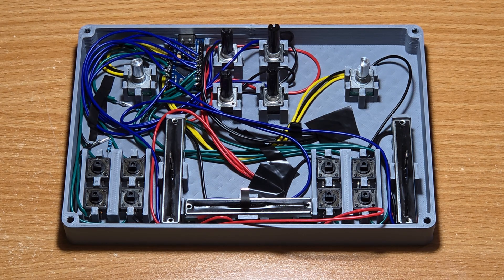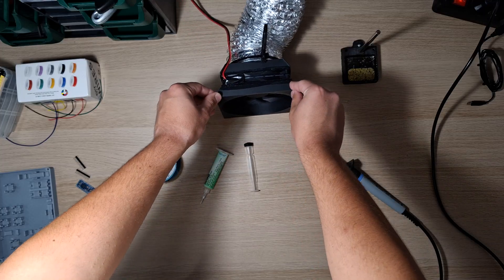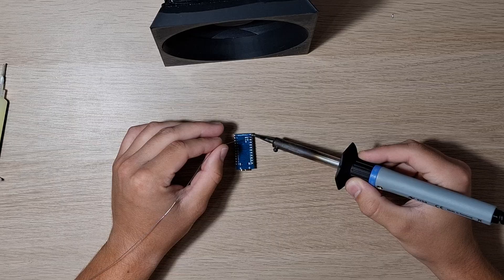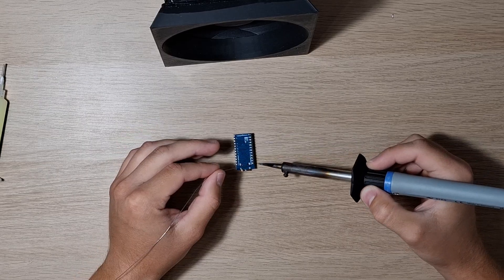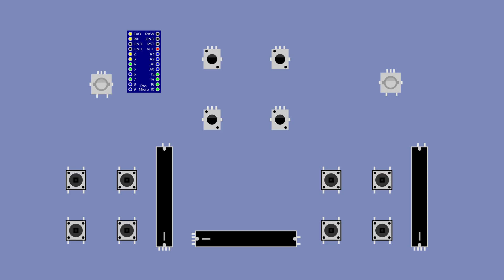Now the hardest and most time-consuming part. My advice is to not hurry — take your time and do it well. The case is tiny and will have less and less space as you add components. If you get tired, go rest and come back later. Solder in a well-ventilated room or use ventilation. Put your safety goggles on. First, solder pins on the Arduino — the black plastic needs to go over the top side. Make short pauses of just a few seconds between soldering each pin, because if you heat up your Arduino too much you can accidentally desolder its components. You can access Arduino pins both from the top and bottom. Keep in mind that after soldering a few components you won't be able to move the Arduino anymore, so plan your bottom pin usage. Simply follow the instructions and wire the components exactly as shown. When you've soldered everything, do not assemble the plastic parts — first test your controller.